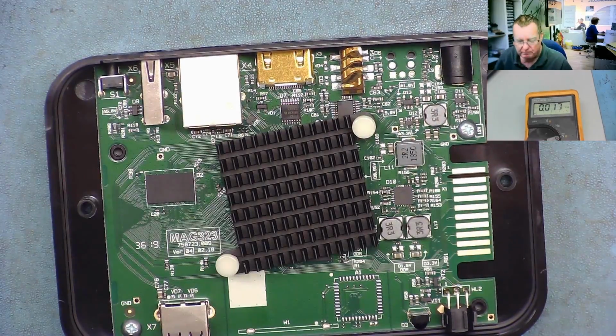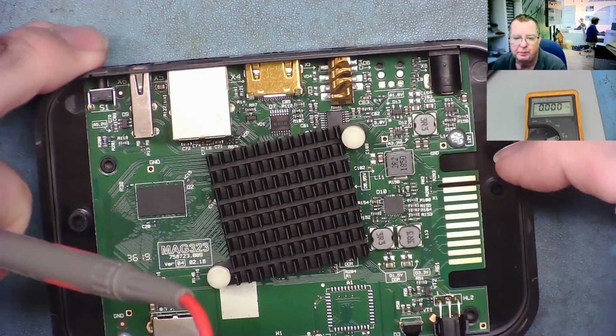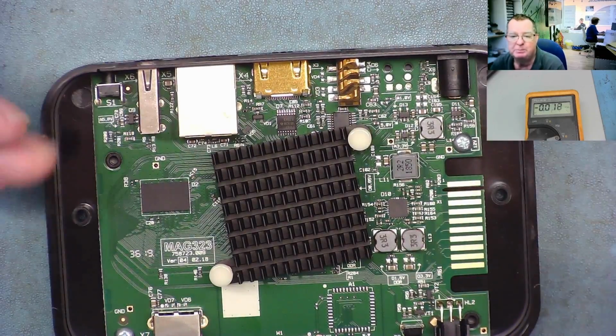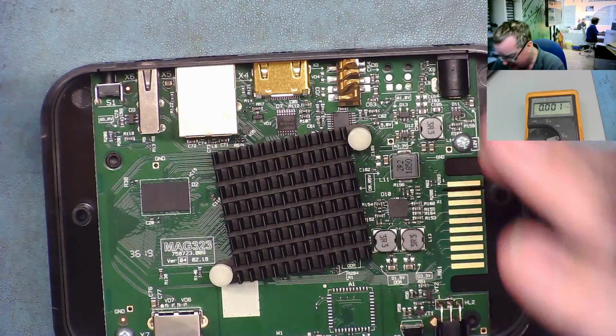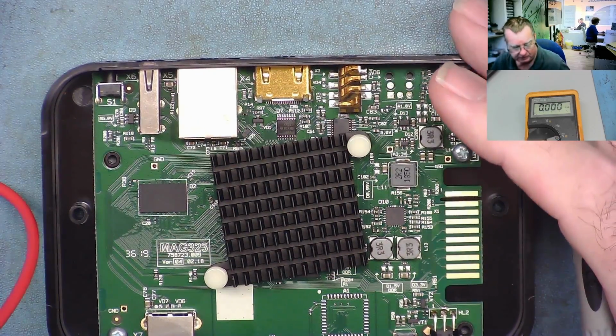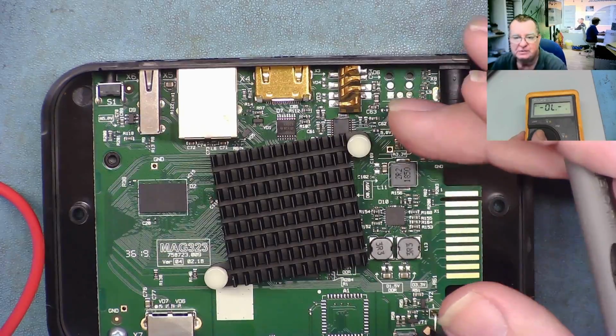And there's two main reasons for that. Either the power supply itself is faulty, quite often capacitors in the power supply have dried up or bulged. The power supply may not be able to deliver power under load, so it will do that. The other common reason, and really the only other reason, is if the load is too low resistance.